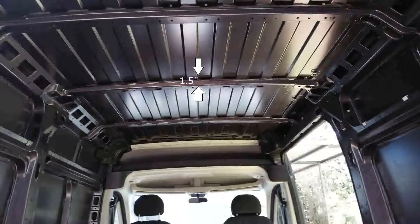The picture you're looking at right now is a ceiling brace — I've marked it, it's an inch and a half thick. The ceiling is the hardest surface to do because you don't want to get any thicker than that inch and a half, or you'll be cutting it off. This closed-cell foam is tough stuff once it sets up.